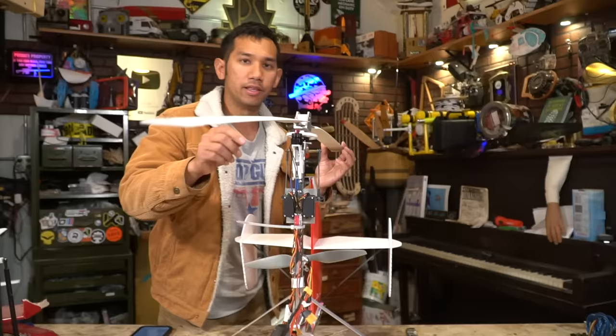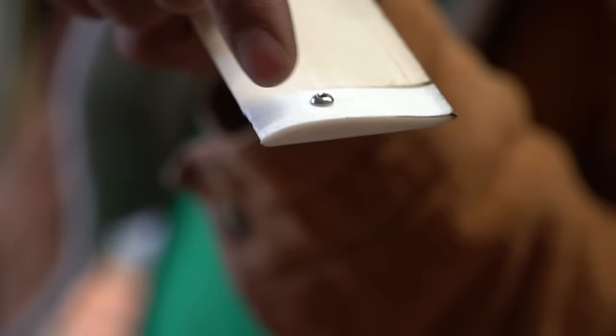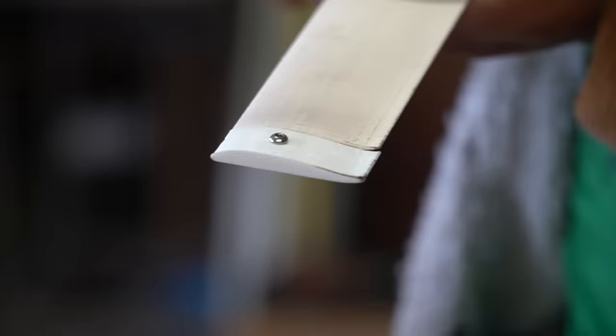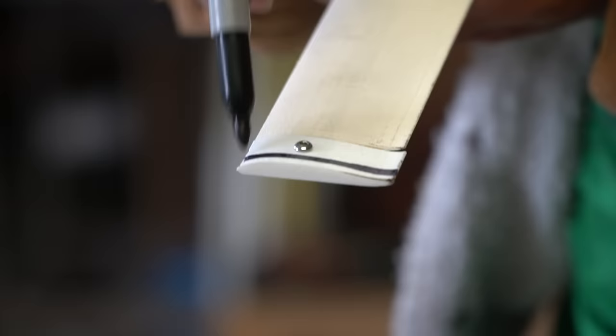In this latest iteration that I'm releasing to you guys, the blades are actually twisted and they taper. I talked to the designer of the Dominator gyroplane at the Bensen Days gyrocopter event, and he told me to add some reflex into the airfoil, which I did here. This greatly improves the performance of this thing because I have more negative twist here to drive the rotor blades. And if you come further out on the blade, I start taking the twist out. And then over here, it actually just goes flat, where it's no longer pitched downwards. It's just level, so hopefully it produces more lift. So more lift is being produced in the outer portions, and more driving force is produced in the inner section of the rotor blades.